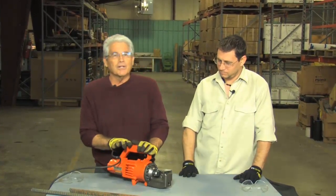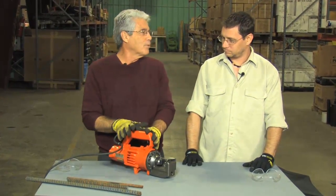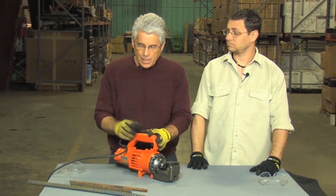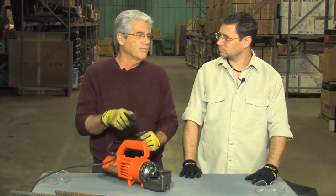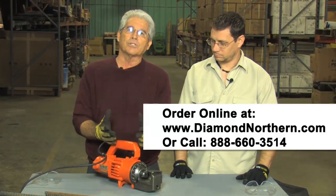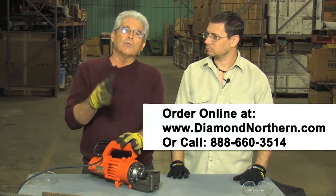Today we're going to talk about our DC20WH, and it is the workhorse. We sell more of this product than any of the other models that we offer, and we offer a range of about six different rebar cutters. But this one is most popular because it cuts not only threes, fours, and fives, but it cuts number six, grade 60 rebar. That's important today because on many construction jobs, they've had to step up from the smaller diameter rebar up to a number six.